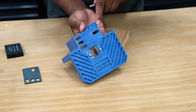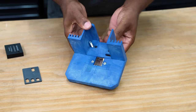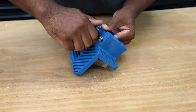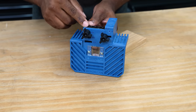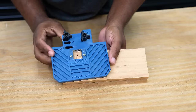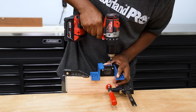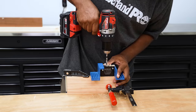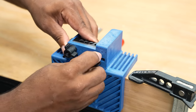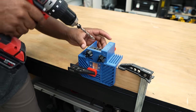I know which holes I'm going with. I'll insert the knobs, set the eighth-inch spacer in place, then take the guide and sit it on top. I'll tighten it in position A and lock it down. The reference line I have here needs to line up to the indicator on the jig. After you drill the first set of holes, loosen up the guide and push it to the B position, then drill the second set of holes.